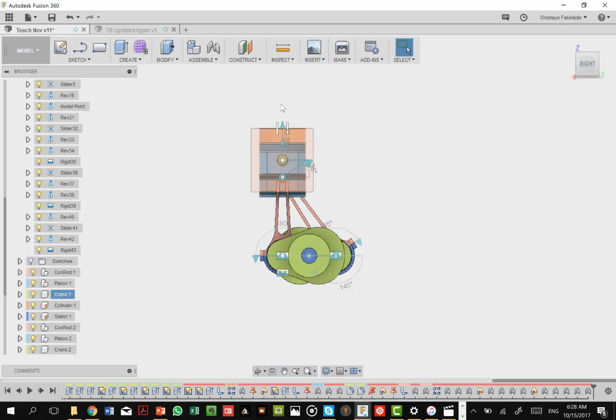This is full misalignment. In actual fact, most modern vehicles are not designed to have full misalignment. Theoretically, simplistically, I would say, this seems to be the best thing, because at the firing point, the full thrust of the fire will be applied to the crank at 90 degrees, which is the way we will crank our bicycles if we are pedaling a single bicycle. The empirical experience of the manufacturers did not allow them to give it full misalignment. Rather, the misalignment is usually somewhere in between full alignment and this extreme case.